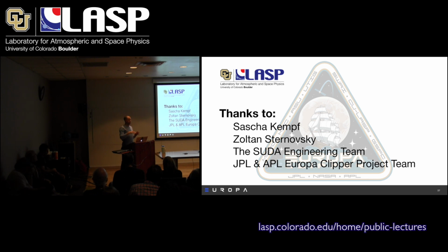Now, that said, we don't plan to build in the capability to reprogram the FPGA on orbit. It's possible. That's not in the plan right now, although we are potentially considering doing that, not just with the FPGA, but let's say we lost one of our ADCs and we wanted to change. On the fly, you can actually change the pin assignments of these FPGAs because you can reload images.